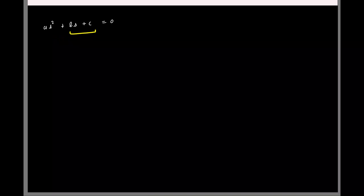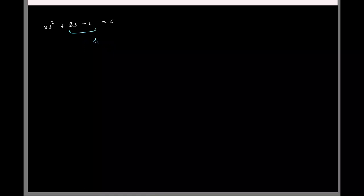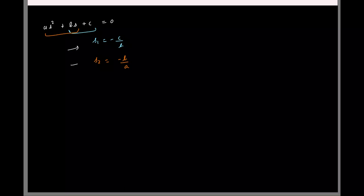And that's what we kind of did, we approximated this equation saying this term only goes to 0, so that will give you the first pole like this. And at a higher frequency, so this will give the first pole, and for the second pole these two terms will dominate, that will give you the approximate expression like this. I mean, we kind of arrived at it by looking at the sum of the poles and product of the poles, but that virtually is the same thing. Okay. Now you'll have a third order polynomial like this.